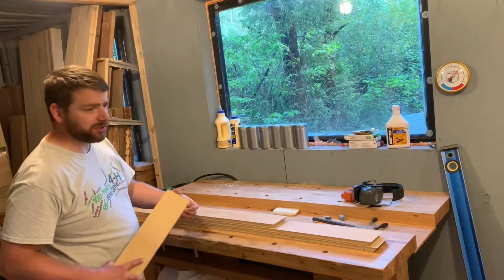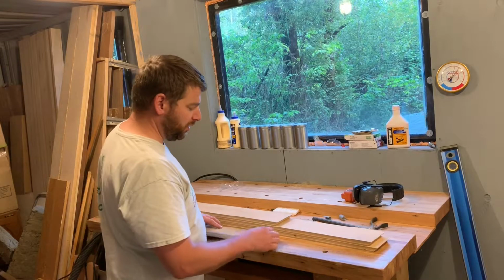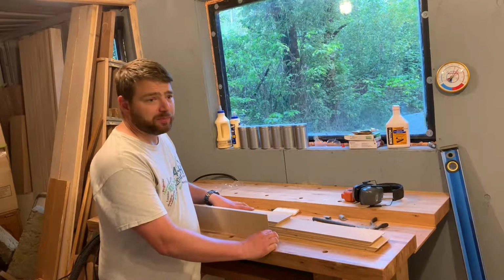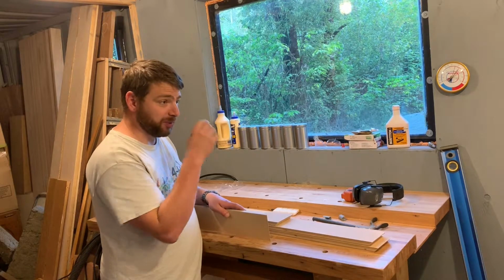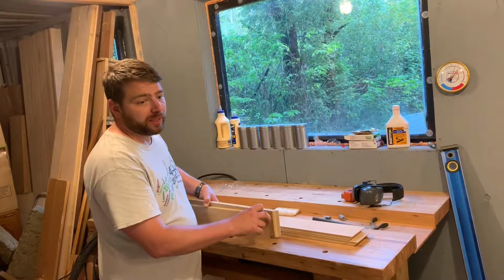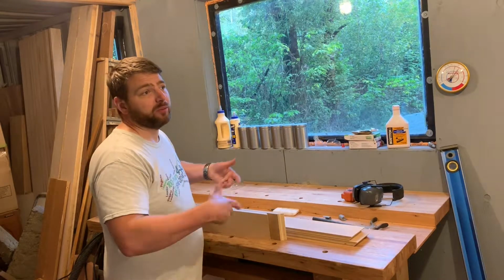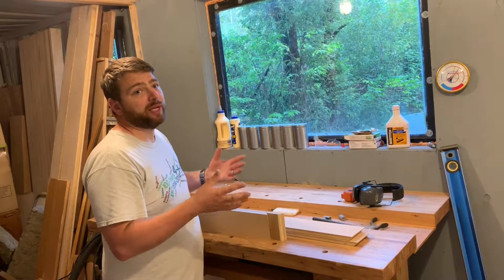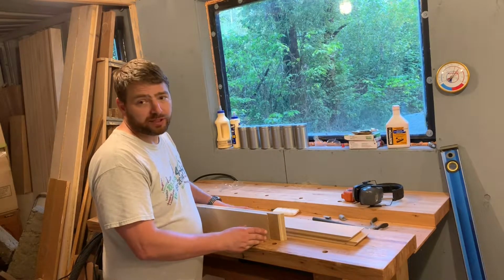It's going to have an inside dimension of 24 by 48 inches, 4 inches deep. Even though the panel is only 2 inches deep, we're going 4 inches because there's going to be a surface mount octobox mounted up on the ceiling, so we can put the new wiring into that and do it properly. And that, along with the pigtail extension coming off the back of the light, I want to have enough room in there that when we put the panel up, we're not worrying about trying to fish wires around, because there's not going to be any extra room in there. That panel's going to fit with just about 1/8 of an inch to 3/16 of an inch of clearance on each side.